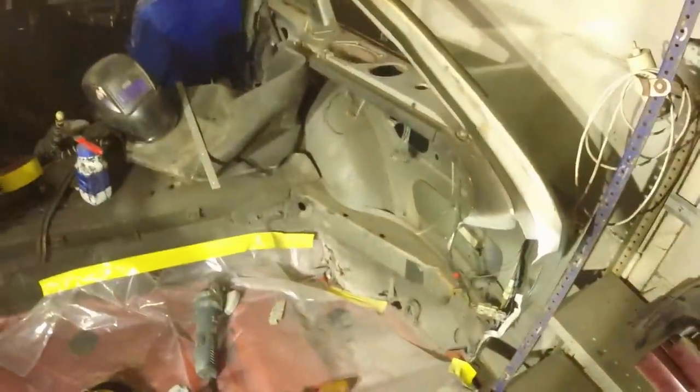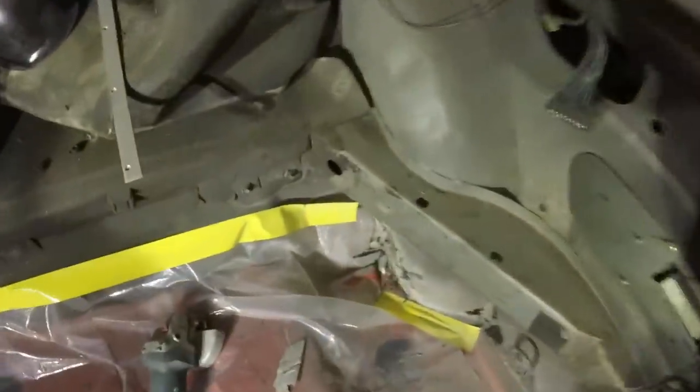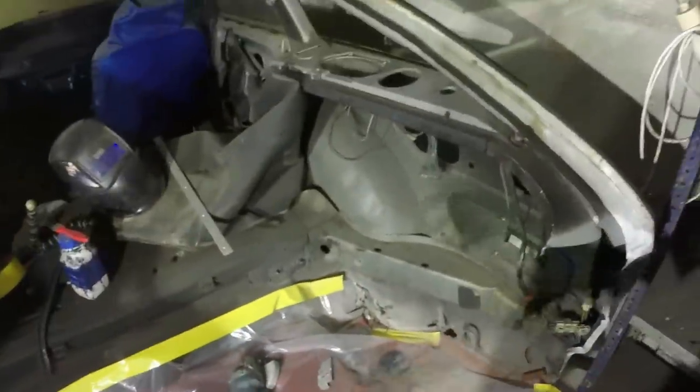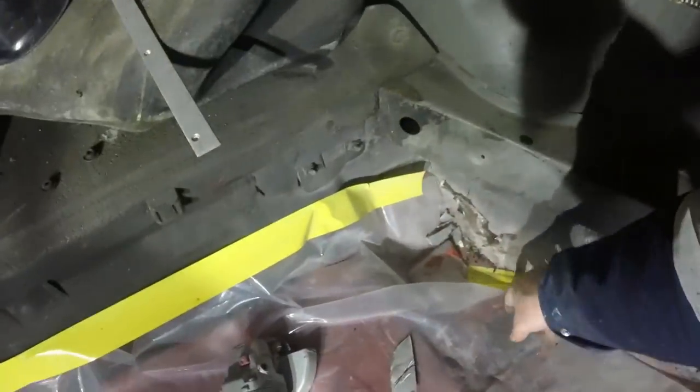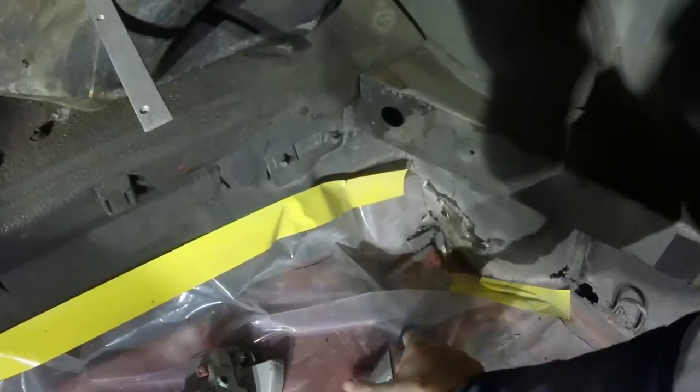Makes good metal. Just when you think you make progress, I thought, well, I was prompted and I kind of figured I should probably repair that bit before I put the rear panel in, otherwise I won't have very good access. So I thought, oh okay, well, I'll just cut the top skin off, that'll reveal a bit of metal to clean up, and then I'll put a plate in.